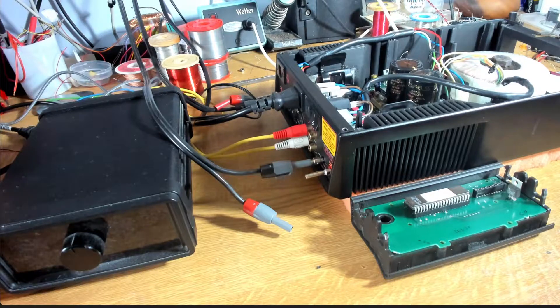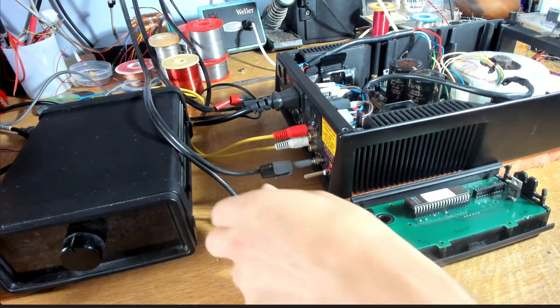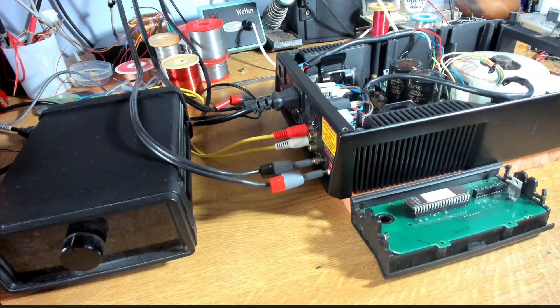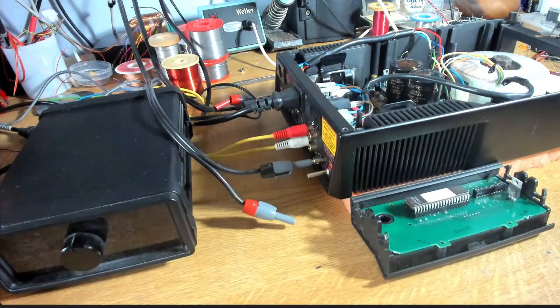The unit is now powered up under its own steam without the front panel, and if I connect loudspeakers we can see the amplifier is working just fine on its own. That's encouraging - that's good. All this circuitry is working. There will probably be some dry caps we need to deal with, but it's functioning.